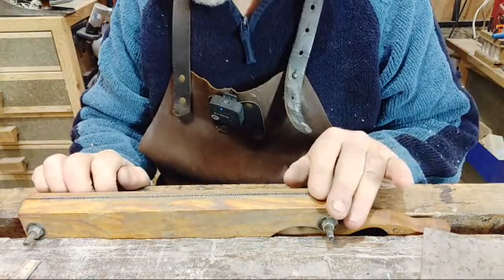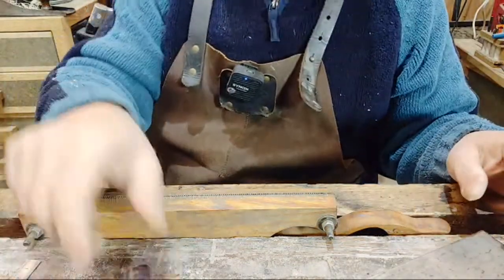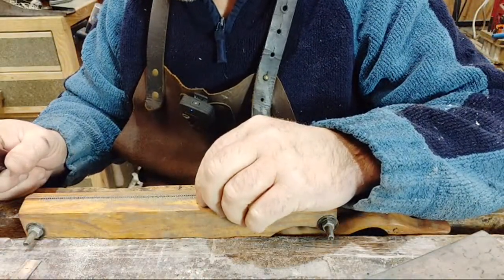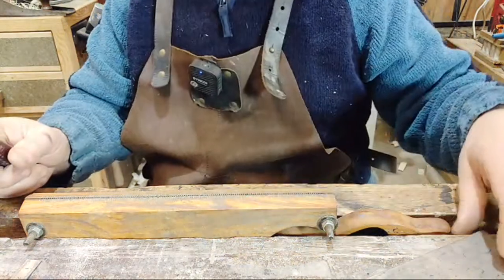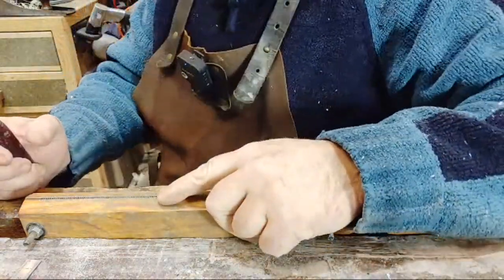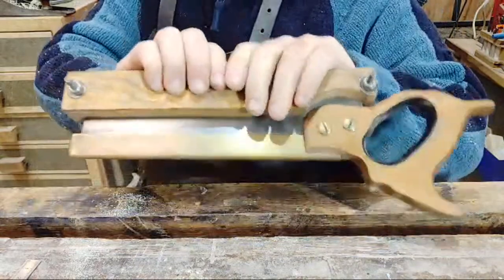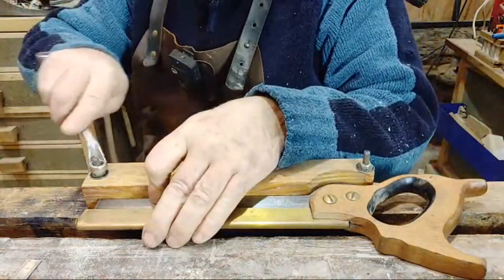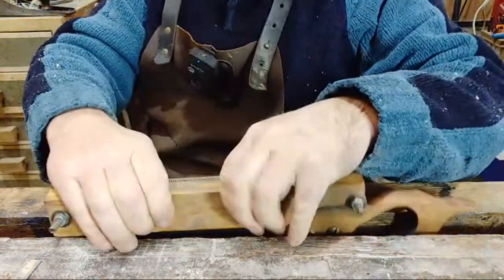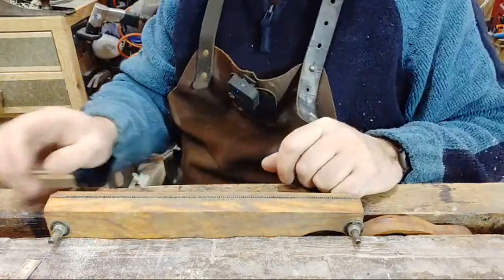But these days, people want to use these ready to go saws, like the throwaway hard point saws. Now, I know the Sandvik 244s and stuff, like all the Jacksaws. They're okay for site work. And they might say they're universal, but there's no such thing as a universal saw. You've either got a cross cut or you've got a rip saw, really. A cross cut formation for ripping is awful. The gullet of the tooth just fills up, they can't clear themselves quick enough.